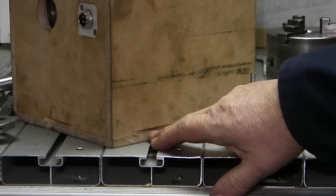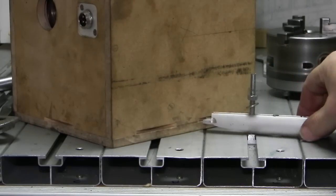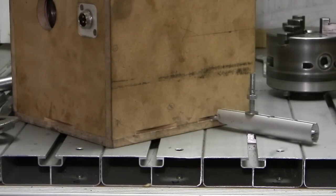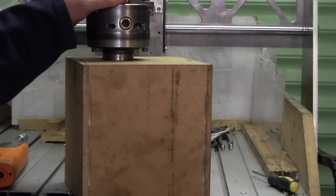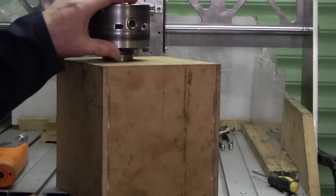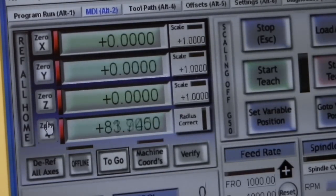I've also put some slots in top and bottom cut with a biscuit joint cutter, where you can put the clamping strips in to hold the head still - that's on each side, top, bottom and the other sides. If you're thinking of making a rotary head, the systems you need from a CNC machine to work this are Mach3 on the computer, the stepper box, and the stepper motor - there's some way of turning your chuck. Thanks for watching, I hope you've enjoyed it. If you have, why not subscribe and we'll see you next time on Earnuts Engineering.